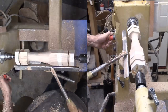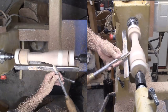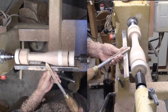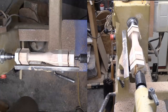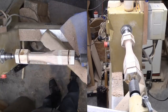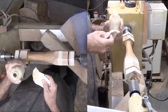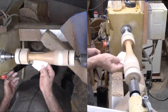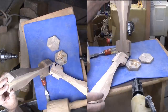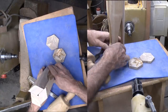A triple is easier at this point than a four stave since the wood does not protrude quite as far. Then sand starting at 80 grit sandpaper. I like to apply shellac friction polish at this point, even if I want to apply other finish later — it helps any glue squeeze out and provides a good base finish. After sawing off the ends of the bundle, the staves were still stuck together; a couple of taps with a mallet and chisel split the staves apart easily.